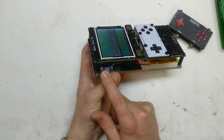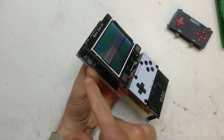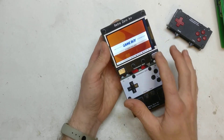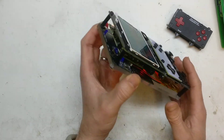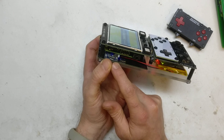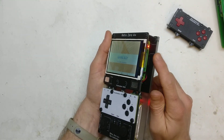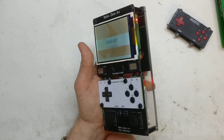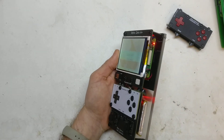I've got the power board at the bottom which is the PowerBoost 500C. I thought why not go for the 1000, but the 500C is about 12 quid and the 1000 is about 20, so there is quite a bit of difference. I also added a USB-C charging port on the side, and there's still the micro USB as well so you can charge from either. I also had the footprint for a female USB so you could charge your phone from the power bank if you wanted to — it's about 3,000 mAh battery — but it didn't really fit and I didn't feel the need. It's there if you want it though.